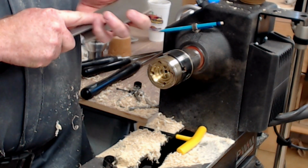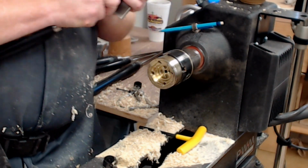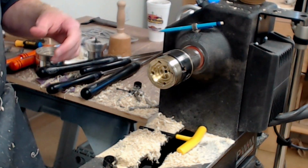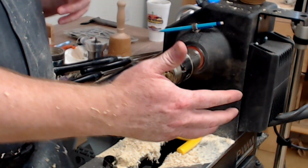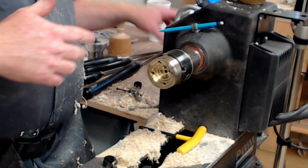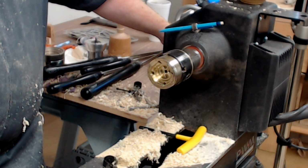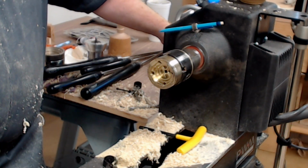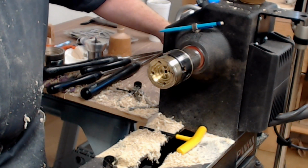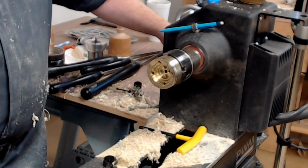That is the one thing about chucking that everybody's got to look at: what do you have, what can they do, and getting the right size. Like I said, if you want to turn big, get a good big chuck. I've got pieces of wood that I honestly can't turn right now because I don't have the proper chuck to turn a bowl on them, at least not safely. I could turn it. I just shouldn't.